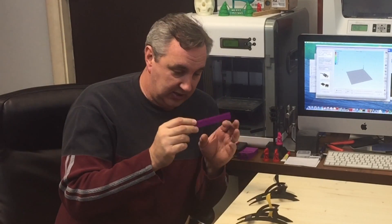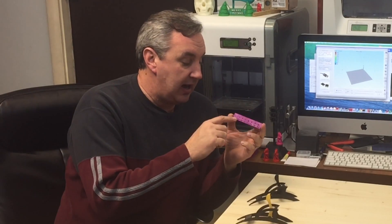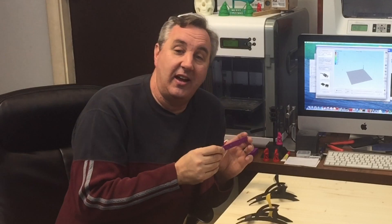At the end of 2015 I hit my first reward level on Patreon, so everyone on Patreon through the end of this month is going to get a special print. It's this hole gauge that I made a long time ago and I use it all the time. It's got 3D printed holes with the dimensions embossed on the bottom. So if I have a 3mm bolt, I can slip it in these holes and find out that even though it's a 3mm bolt, I need a 4.5mm hole for it to fit because of all the shrinkage. I'll put a nice thank you or logo on it for everyone supporting me on Patreon.